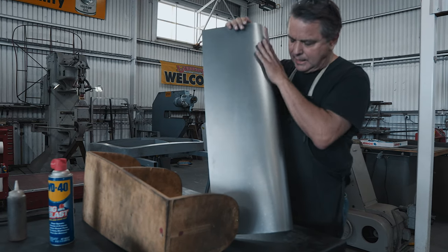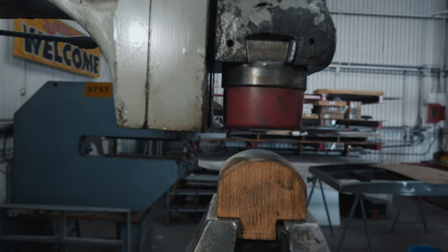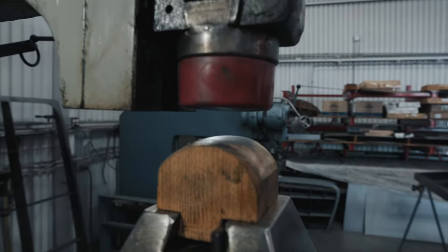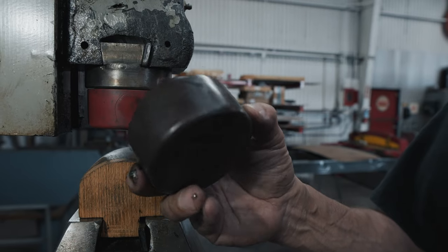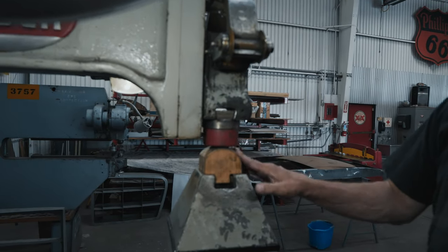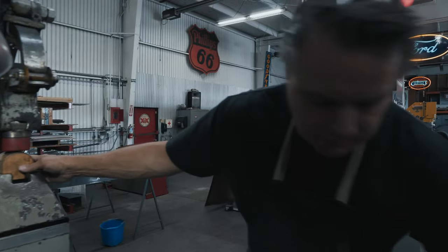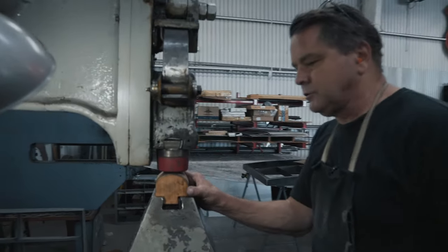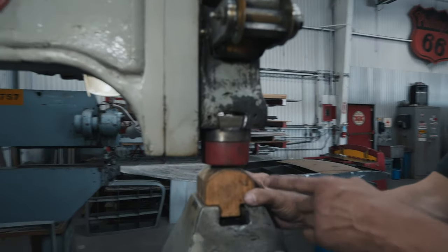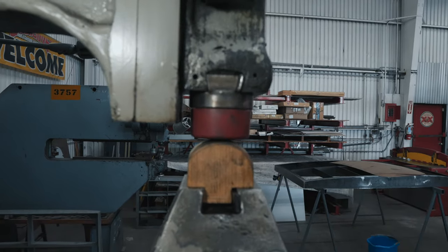So you can do it by hand with a hammer and dolly and things like that, but it takes forever. I've got something set up in my power hammer. This is a setup I made — this is a rubber upper die, and it just uses three-inch screw-on hammer heads that I got from McMaster-Carr. The bottom die is a piece of poplar wood that's just been shaped to a crown for forming. Since this isn't metal to metal, it's really difficult to stretch the metal, because metal to metal is what it takes to stretch. But notice it's just the rubber — and that's as loud as it is. Isn't that nice? It's the only time this machine's quiet.